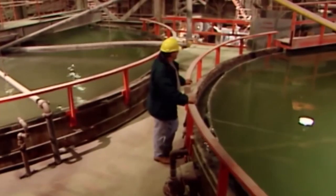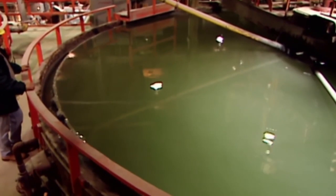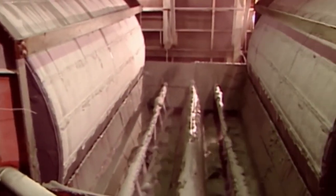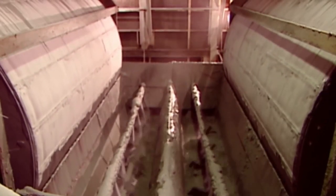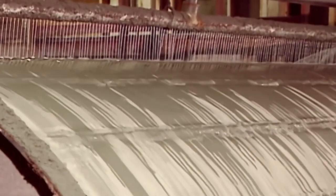This pulp flows into large settling tanks. The wet solids, being heavier, sink to the bottom, while the water at the top drains to another area. Workers transfer the wet solids to an agitation tank and blow in air. The oxygen sets off a chemical reaction between the cyanide and the gold trapped in the ore, triggering the gold to dissolve and leach into the surrounding water. Drum filters then separate the water from the solids, and this water now joins the water that was separated earlier.